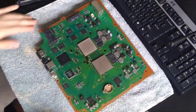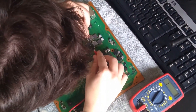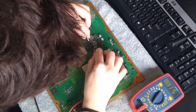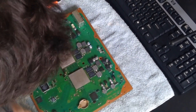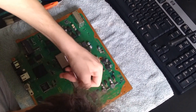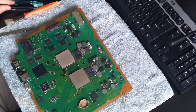Taking a look at this part of the board, I've seen some leftovers of aluminum tape, which probably means that someone tried to reflow or reball it. There was also a solder ball between two of the capacitors, which obviously doesn't belong there. So someone attempted to reball or reflow it. I then started cleaning the components and the glue residue from the aluminum tape with isopropyl alcohol. Knowing that this unit was previously reflowed or reballed is really important at the end of the video.